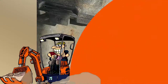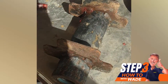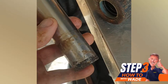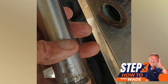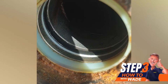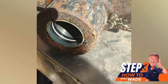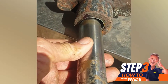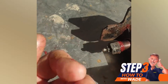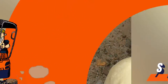Next I put the piston on the bench and was able to pull the inner piston out by hand, mainly just for inspection. I'm going to run a little bit of emery cloth over this area here with some slight rust and pitting. It came out very easy and clean, and the seals looked to be in pretty good order — no grease leaking out of the piston — so I'm not going to replace the seals. If you had trouble pulling the piston out by hand, you could put the grease nipple back in and give it a few pumps of grease to force it out.